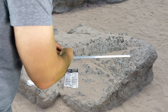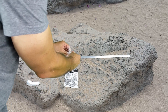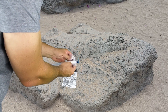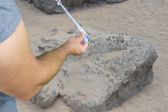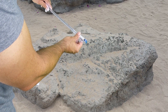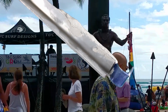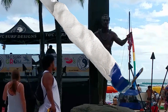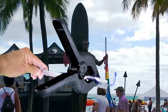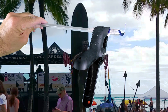Now I am going to prepare the JB Weld by mixing up the two-part epoxy system with my fingers before applying it to the aluminum rod and pry bar. There really is no clean, pretty way to apply the JB Weld — you may as well accept the fact that it's going to be ugly and just use as much as you need. Notice how I took the glue all the way around the sides. I have now applied the clamp to hold the two pieces together. The instructions on JB Weld say that it will be ready in an hour, but I have always let it dry overnight, and I have not had one break yet.